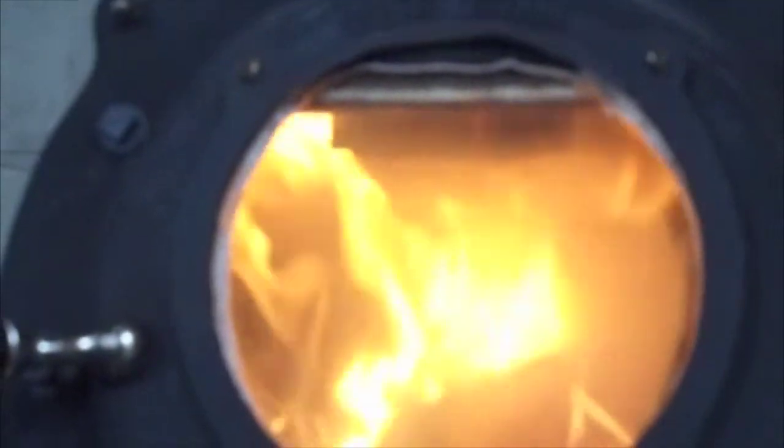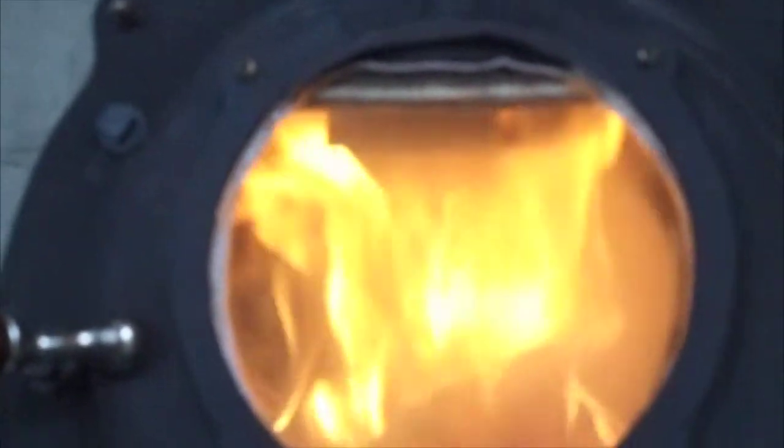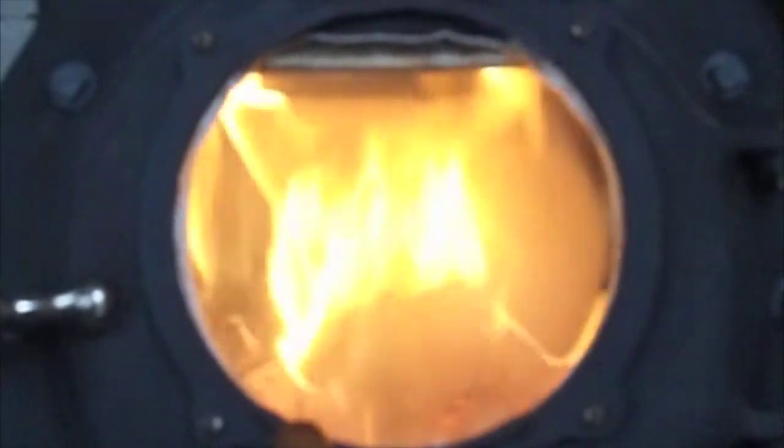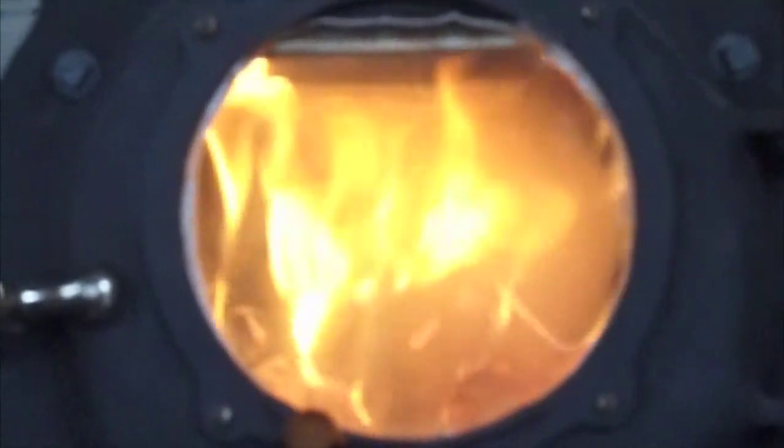There are two things those flames are chasing: the flames indicate oxygen coming from the reservoir, they're chasing the heat which is up high next to the baffle, and they're chasing the smoke coming off the log — the fresh smoke coming off the log — which is what we're seeing as we look directly into the center of the firebox.